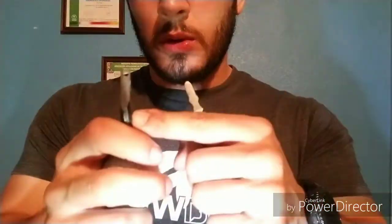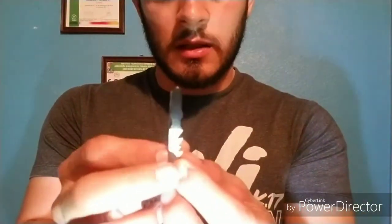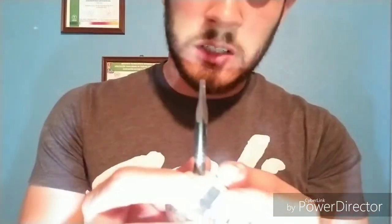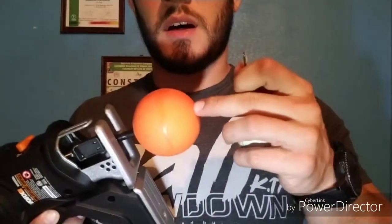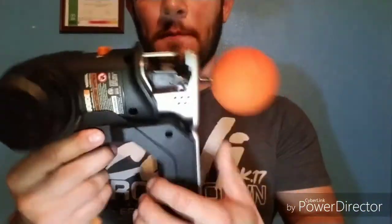This is how I did it — I tried several different methods and this is the one I like the most. I grabbed a half-inch bolt, bought a golf ball or lacrosse ball, drilled a hole, filled it with epoxy, and put it in. I tried to give the bolt the same shape as the original blade that comes in the box — I traced it on the bolt and ground off the excess material until it fits on the machine. At first I used a golf ball but it didn't look as clean, so I bought a lacrosse ball, made the hole, glued it with epoxy, and this is how it looks when it's done.